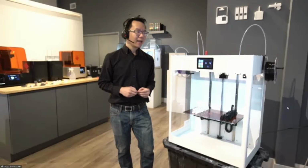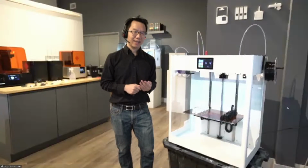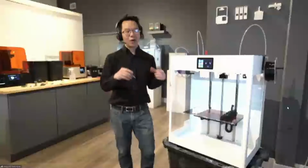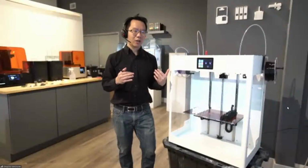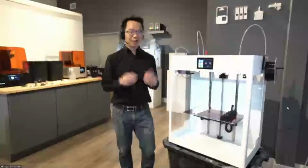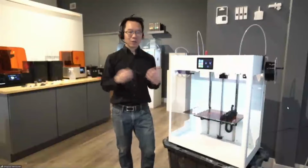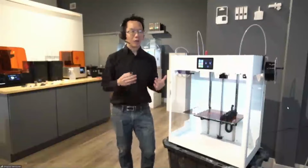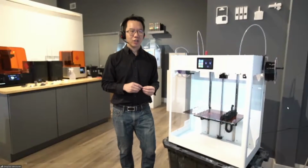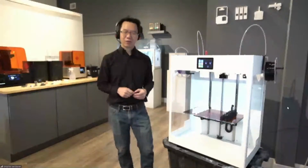Felix touched on the software, where expert mode shows you all the pictures and explanations. I want to highlight that one. Check out the software if you haven't seen it yet, because that part is really cool. If you change any of the settings, for example shell size, and you increase that from 2 to 3, you see a video in the software itself that shows exactly what it does in G-code. That's the best way I've ever seen the expert settings explained. So for someone who's getting into 3D printing, is relatively new, or wants to dabble more in the advanced settings, it's very informative to go through all the settings, change them, and see what they actually do in the G-code in real time. That part I really want to highlight for people to check out. So yeah, those are my main takeaways from the Craftbot system.